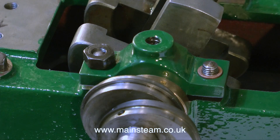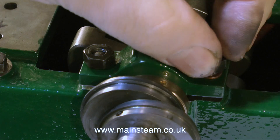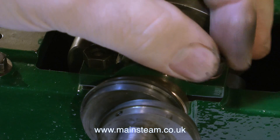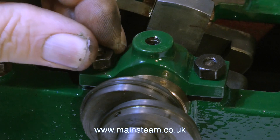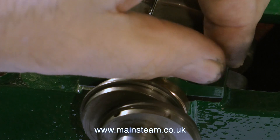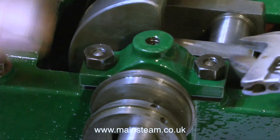If you don't put a washer in place, when you tighten the nut onto the paint it will just remove the paint and make it look messy. This is not a highly stressed component - its only purpose in life is to hold the bearing against the other bearing. It does not need tightening down with a great deal of pressure.